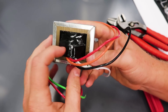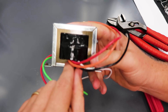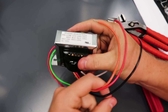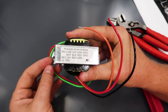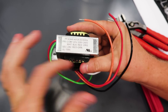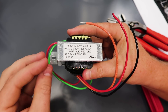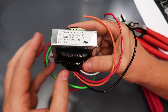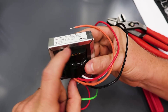Really, inside here you just have an electromagnet. You've got an iron core that goes down the center, and it transfers electromagnetic energy from the primary to the secondary via magnetism without the two actually touching each other. The primary and the secondary never actually touch — they're connected through a magnetic field, known as magnetic flux, because both wrap around this iron core.